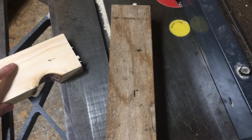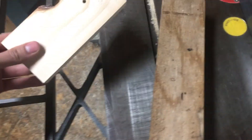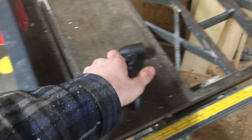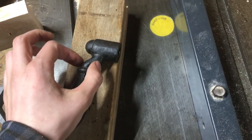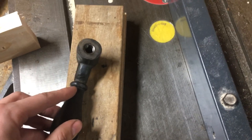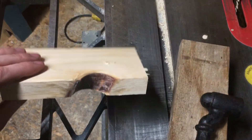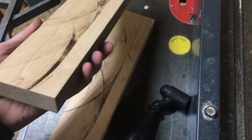Here I am in the shop with some wood to make the pattern — this is pine. I decided the pine would be too light, too thin for the job. Here's the part I'm trying to replicate; it's pretty small, about a half to three-quarter inch. When you split that in half to have the two halves for the mold, it gets pretty wicked thin, and the pine won't hold up — it'll break. So I've chosen what I think is oak, found it upstairs.